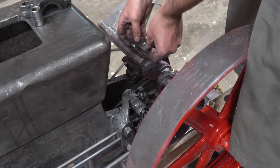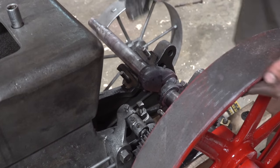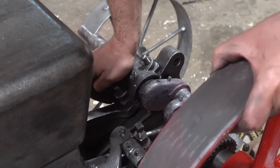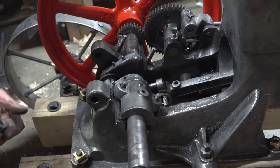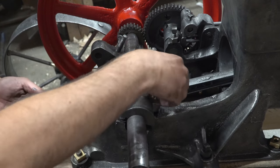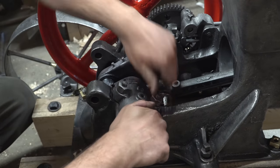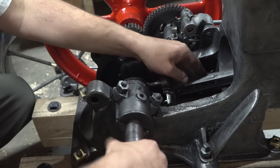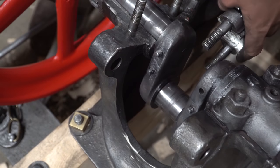I'm also reinstalling the original shims. They were stacked four shims high and I'm removing one. I didn't touch these babbitt bearings at all, so I'm just going to remove one shim — that should tighten things up a bit and bring forth a new surface for the cleaned crankshaft to ride on. As long as it moves freely and doesn't have any play, I'm completely happy with that.